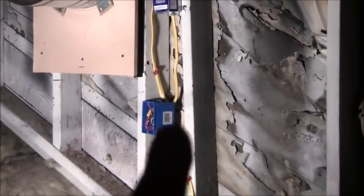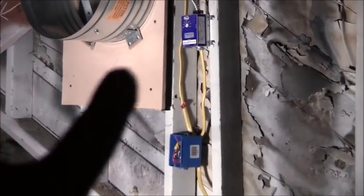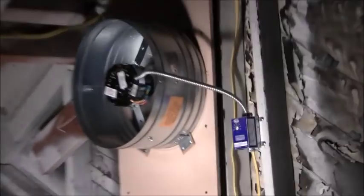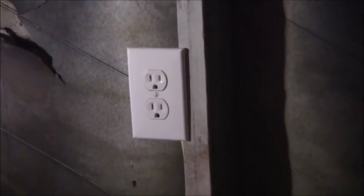One wire going up controls the fan by the thermostat plus the override switch. I also installed an outlet up there. It's a convenience outlet so I can hook up a light without running an extension cord through the hatch. Now I can just grab power right up here. I'll go see what the decibel rating is outside.